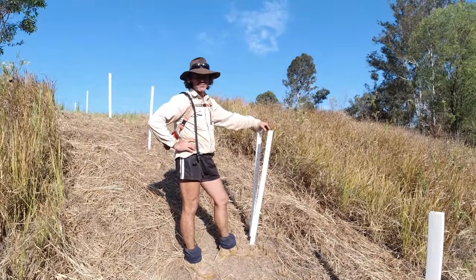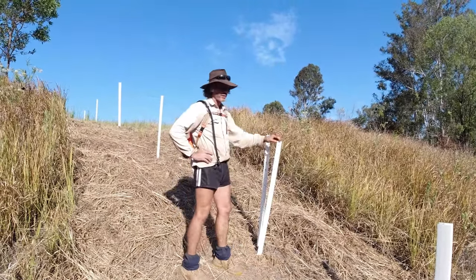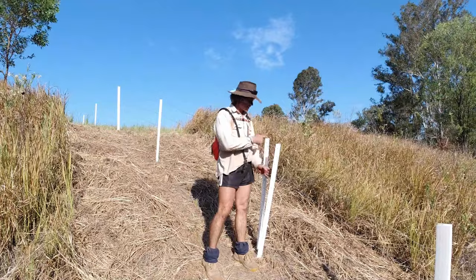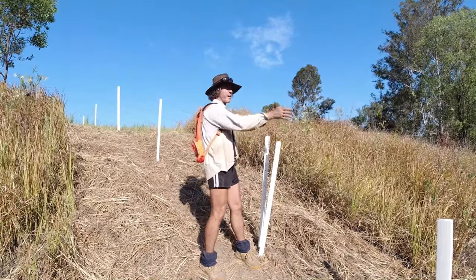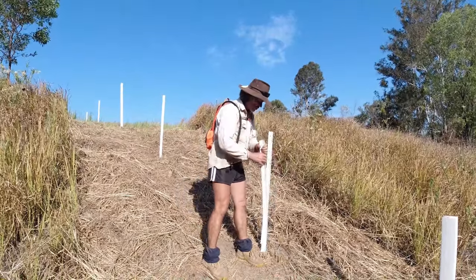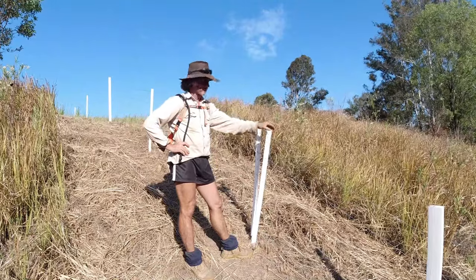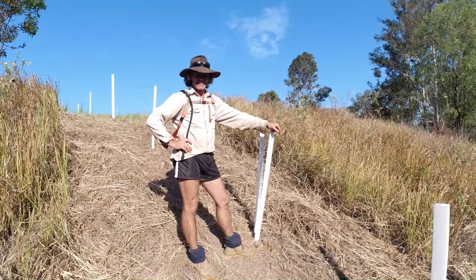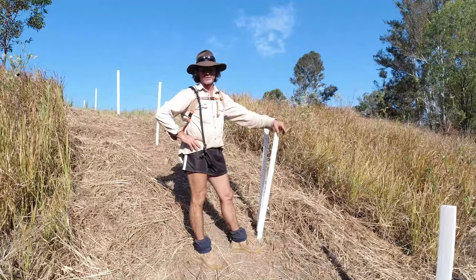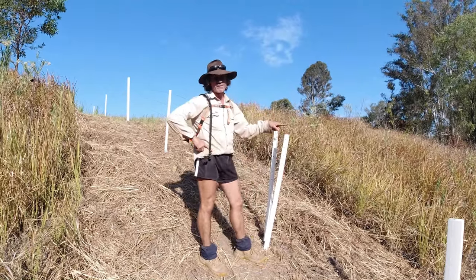People often ask me: are they easy to take out of the ground? Can you pull them out if you make a mistake? When I put these T-posts in about three days ago, I had my string line on the wrong side of these H-posts - hence why that one is sitting there by itself with no wire through it. I realised the rest of the line was on the back of the H-post, so I had to redo it. I tried for hours no matter what I did to wiggle that out, and I tried pulling it out multiple times - it will not come out. So no, these aren't going to pull out of the ground easily. But if you've got a star picket remover, just use that - you're not going to hurt the PVC post. On this one I'm going to use a kangaroo jack - like if you're changing a car - bring it down with a chain on it and just jack it out of the ground. There's no way you're ever going to pull them out by hand.